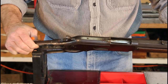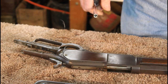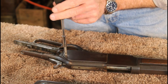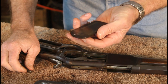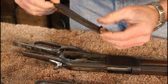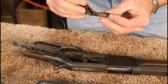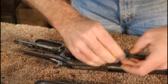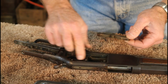We'll get the side plates off now and see if we can get the bolt and toggles out of the gun. Here's another screw head that's in pretty rough shape — we'll clean that up after we're done. Thankfully this thing's not near as gummed up and hard to get apart as some that I've worked with before. Even that side plate came off nice and easy. The toggles came right out of there with a little oil on them. The other side came out just as well — they're in excellent shape, no play in the linkage, pin holes aren't wallowed out, pins look good.